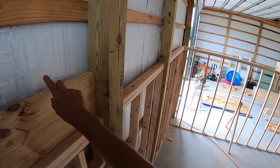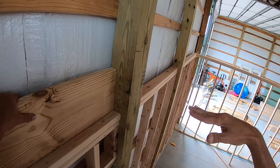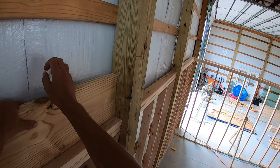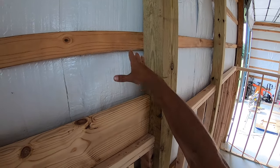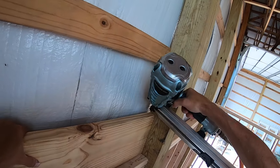The purpose of these rim joists along this wall is that even though the main joist is going to be bolted on here, the subfloor is going to come across all the way back. The other wall that we're going to have to build up here will have to sit on that, so that's why I've got to pull these pieces in.